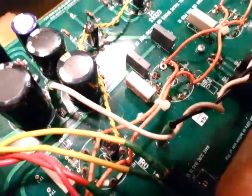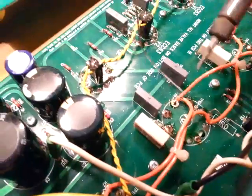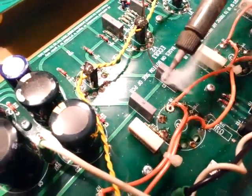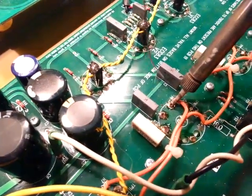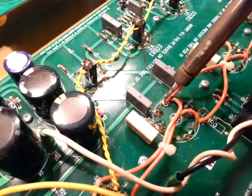What we want to do first when we're filling a good-size hole like this is do it in stages. Usually I'm doing all the pins at once — just go ahead and load up the end of your tip with some solder, get it down in there, get it nice and hot so it follows the pin down.